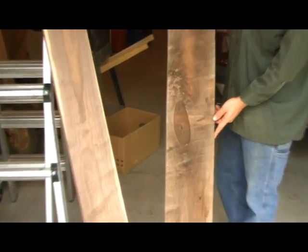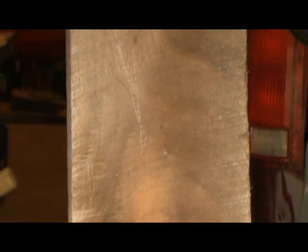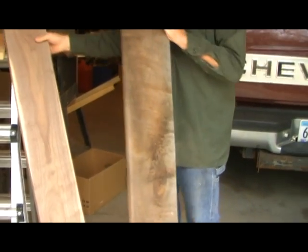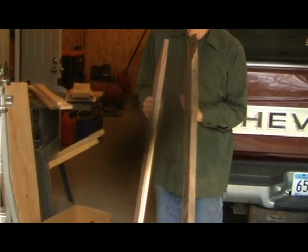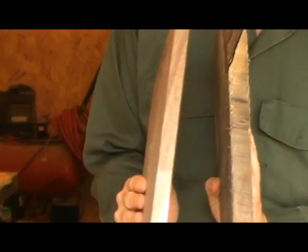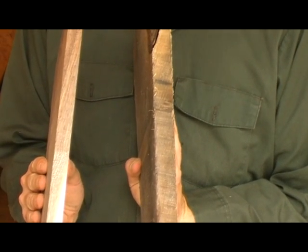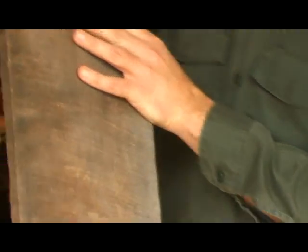In this case, you can kind of see the pattern of the circle blade, because this was cut on a circle mill. You can see the discoloration. There's a little bit of discoloration from some water that sat on it. And of course, there's obviously some knots and some other imperfections in this piece. But if I were to plane this down, it would be very similar to the finished board over here. And then you can also see the thickness difference. This is the 1-inch rough cut versus a 3/4 inch finished. But the nice thing is once you run this through a planer and get it all cleaned up, it doesn't look very good right now, but it'll clean up quite nicely like that other board. So beautiful wood. Yes.